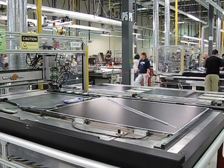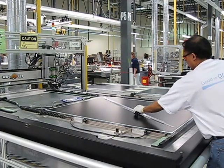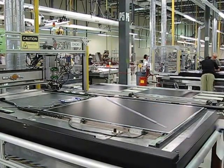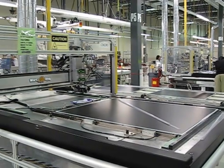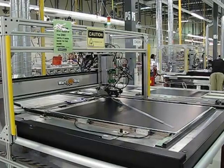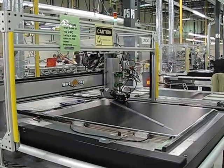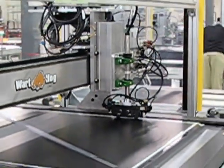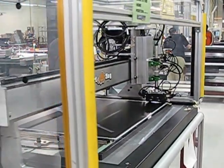His next operation is going to assemble these air gap spacers. This is what gives the air gap between the black resist on that detector sheet. It gives that air gap so that when someone touches with a pen, the pen itself will make contact and the computer will sense where it is on the board.